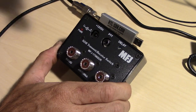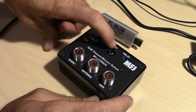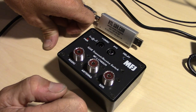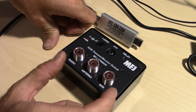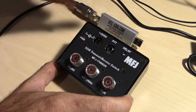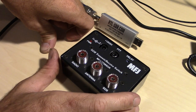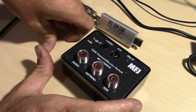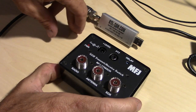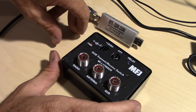It does require power. It comes with a 12-volt DC cord that you have to use. The PTT line is coming from your radio as like an amplifier keyer circuit, and it's going to ground out the circuit and switch the relay inside. As a failsafe, it does have RF sensing inside, so if the PTT line is lost, it'll automatically keep it in transmit mode without going back to SDR using RF sensing. I don't have that cable for my radio — I need like an eight-pin from the tuner jack on the ASU to an RCA for keying — but your radio may have that PTT, and it's doing the same thing as the amplifier. There is a backup failsafe in there with the RF sensing.